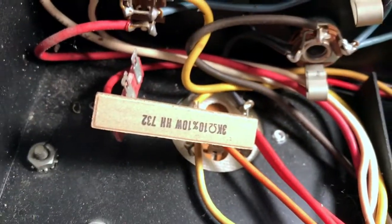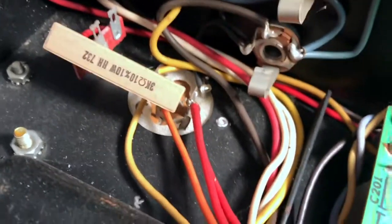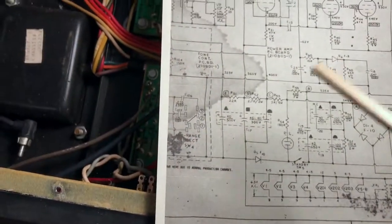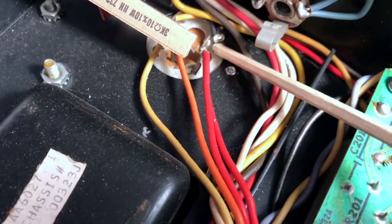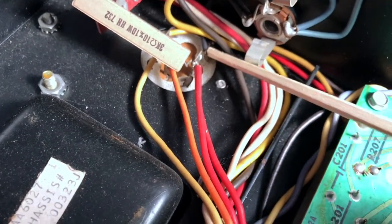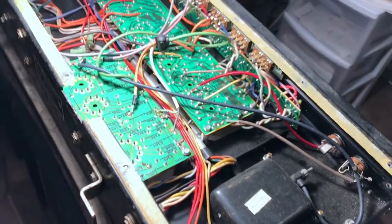All these lines, this canister here is for the preamp nodes in the circuit. And if I were to show that, this canister at this end are these three capacitors. Now, this capacitor is the common ground at 0 volts. It's not as if any of these are in series. However, you can see that this is, as we discussed before, not connected to the chassis anywhere until we follow it all the way through the end, back up onto this board, and back to the input jacks, which is where that is connected.